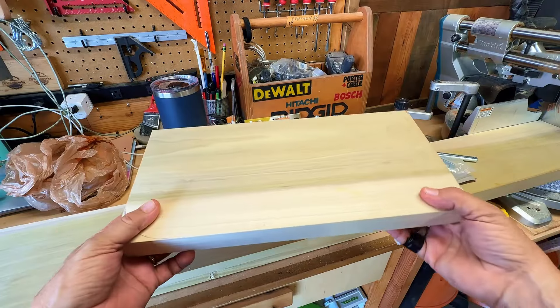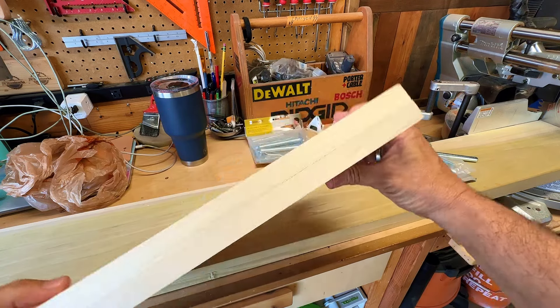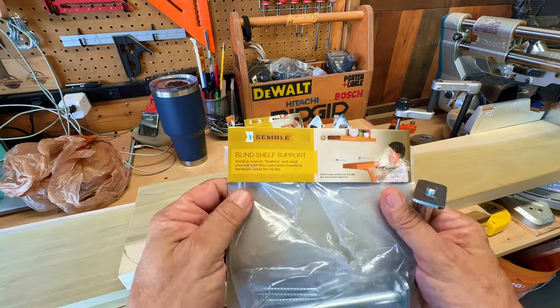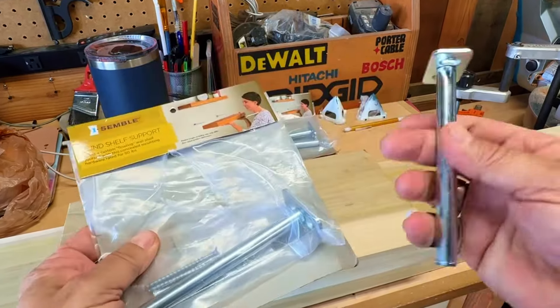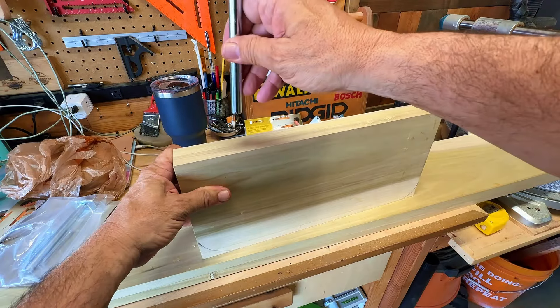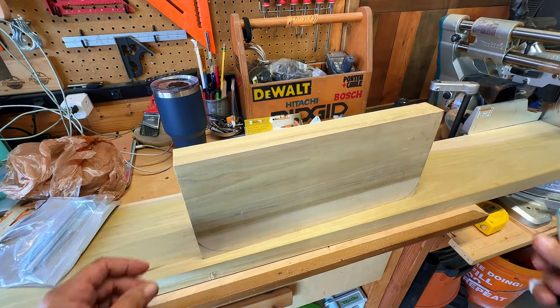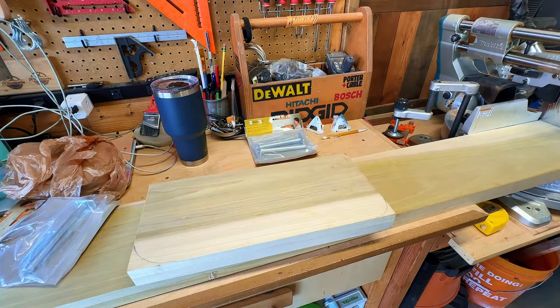I have the cutoff of the board and we'll use this for a practice piece. I'm gonna cut the corners and then round over this entire piece top and bottom to give it a nice little mid-century look. Let me show you the hardware I'm using - I got it from Rockler. It's a blind shelf support. I've never used this brand so I'm gonna practice drilling a couple times with a guide, do a little practice piece first, then do the main shelf for real.